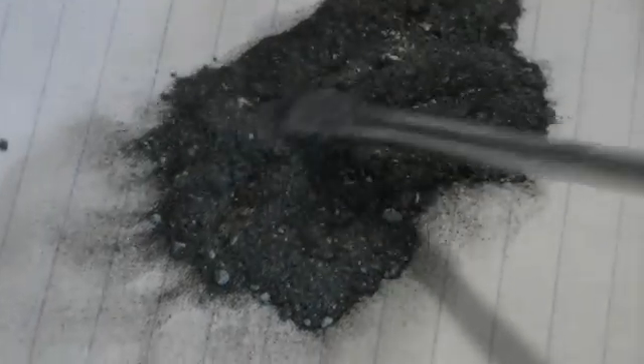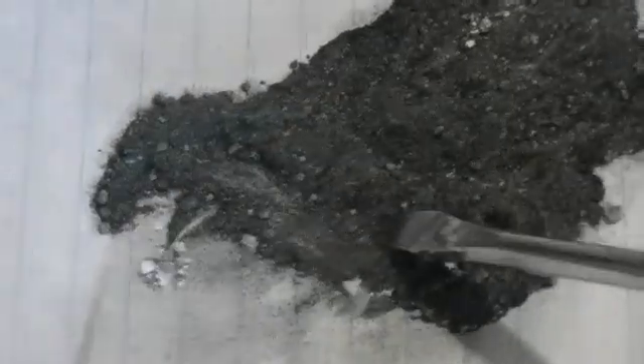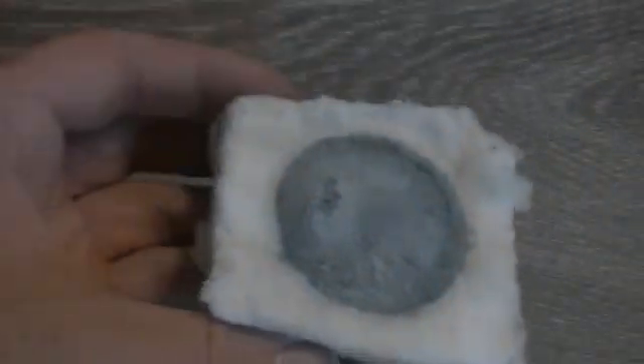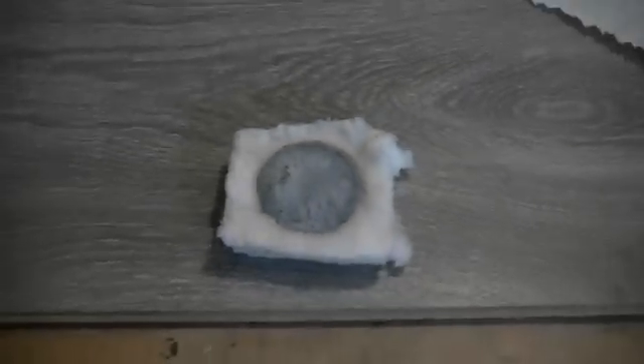Pouring out the contents of the alumina crucible and examining them carefully, we don't appear to see any large nuggets of zinc metal. On a more detailed look at the alumina wall covering the crucible, we can see a deposit in the form of a ring — it is possible that zinc metal is responsible for this. The zinc metal is being produced above its boiling point, so it evaporates, condenses on the wall, and unfortunately, because air is present, it probably turns back into zinc oxide. Inconclusively, I think we've shown that carbon can reduce zinc oxide to zinc metal at elevated temperatures.